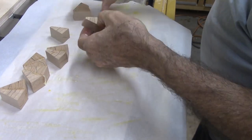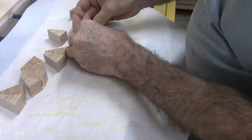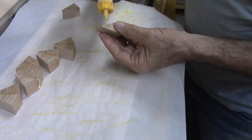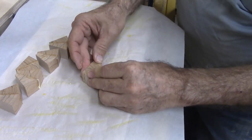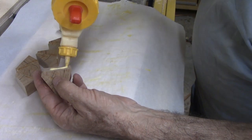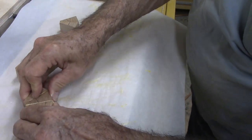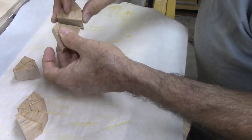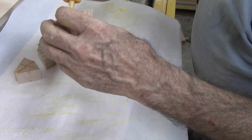While the sled can also work by aligning the wood to the operator side of the top arm and the far side of the near arm, I prefer to use the far side of each. This means the saw blade will be putting pressure on the board in the same direction as I am holding it — otherwise it would be pushing the wood away against me. Safety is important. I do not have a guard for my sled. Instead, I am counting on two things: one, my saw is a SawStop that will almost instantaneously stop the blade if it senses contact with my flesh; and two, I am totally focused on that saw blade while the saw is running. When I lift my little finger, that is my signal to push the sled through the cut. If you do not have a SawStop, make a guard and use it.